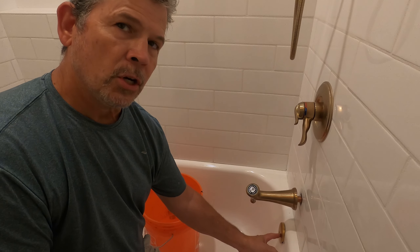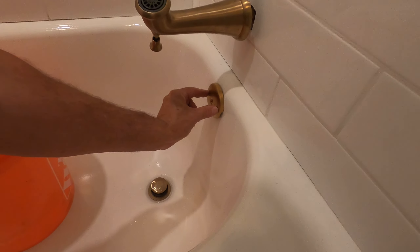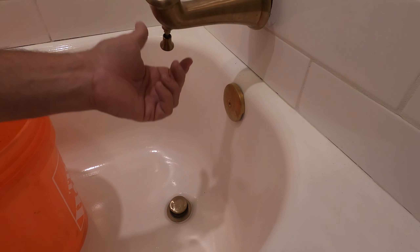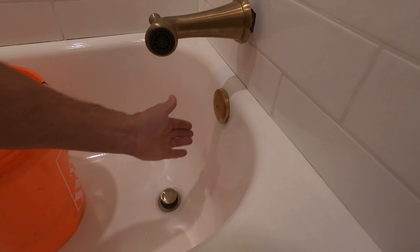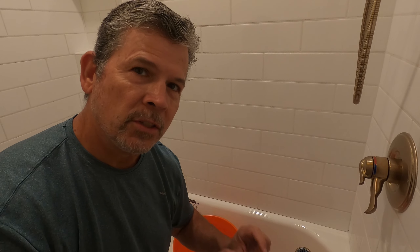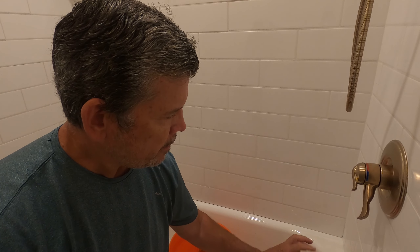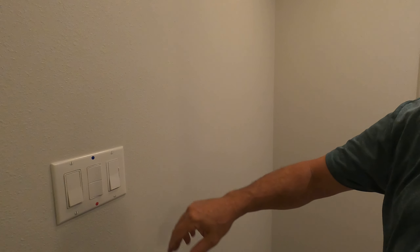You may have noticed that during rough-in we had a galvanized steel nipple — I've since changed it to brass. That way when you turn this on, you don't get rusty water. First time I turned it on, black water came out because the inside of that nipple was just steel pipe. We also had a challenge with the overflow cover — the one that came with this had two holes that did not line up with the holes in the overflow fitting behind the tub, so I had to go buy a replacement.